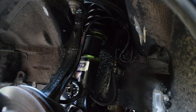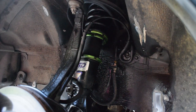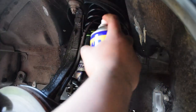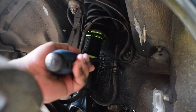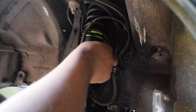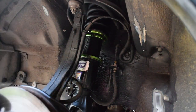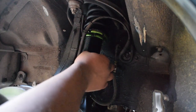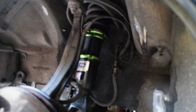Wow, that is dirty - what's that, three years of grime? Going to smack it with some penetrating fluid. All right, so first we're going to knock out this locking collar. I've loosened it beforehand and I've used the towel on the actual flathead so that I didn't damage the collar, but that means we can now move this up and down.